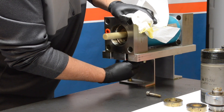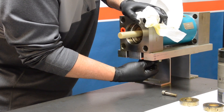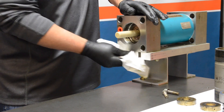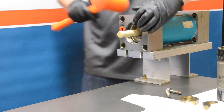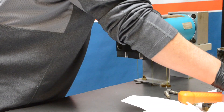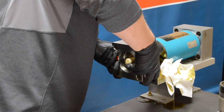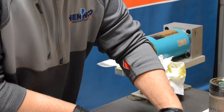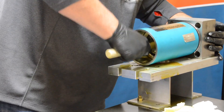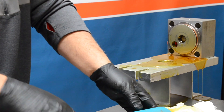Next we're moving on to disassembly of the center section — specifically the two hydraulic end caps. Re-take out one side of the screws holding the intensifier to the workbench and set aside. Be prepared: this customer intensifier didn't have as much oil removed as it should have. Use a rubber mallet to lightly tap the end bell free from the cylinder, then pull it out and set aside. Have paper towels or shop towels ready for oil. Once the oil is under control, put one hand on the plunger sticking out and gently pull, keeping things parallel, to pull out the center section with the two pistons from the hydraulic end cap.